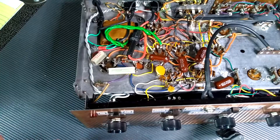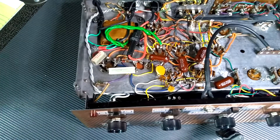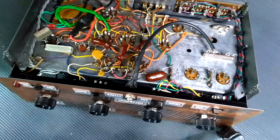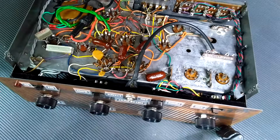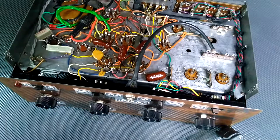I kind of had to guess at the resistor value because I don't have a schematic for this thing. When this amp originally came to me it had a really loud hum. After going over the circuits, checking everything out, replacing the burnt resistor, and putting the three-wire cord on it, that hum is pretty much gone. The amp is pretty quiet now, so that took care of that little problem.